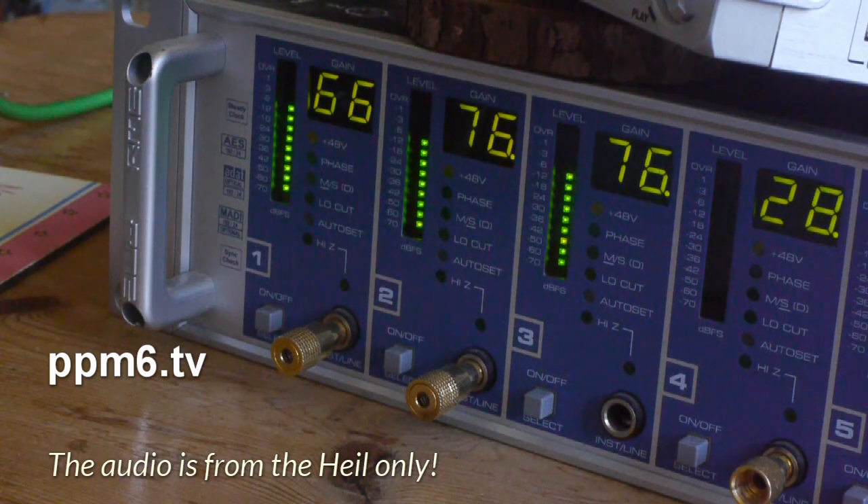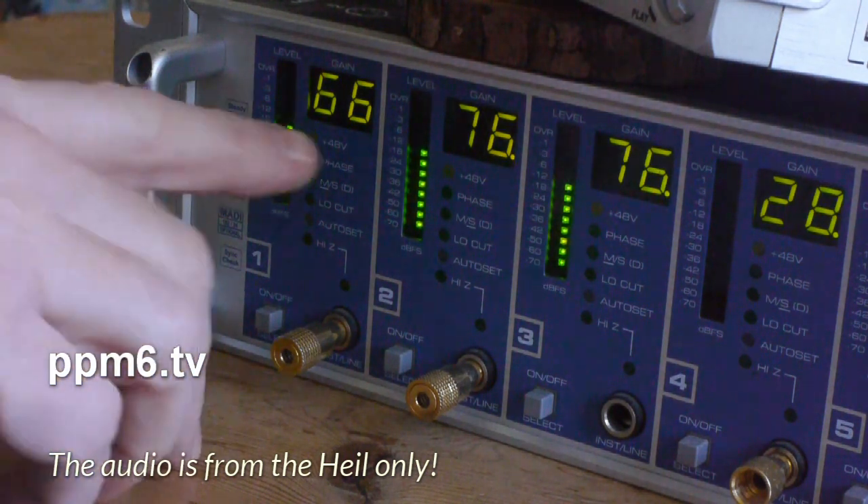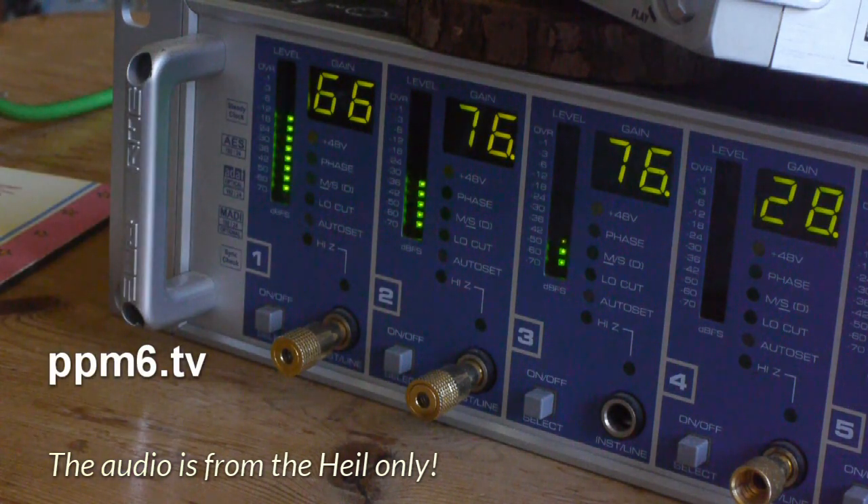Let's check out those numbers. I'll grab my noise maker and switch it on. The Heil, as you can see, has got 66dB of gain in it, just up against the windshield. Next to it, the Shure SM7B channel — you need about 10dB more gain to get into the same ballpark. Now to the Aston — same, same, really. Maybe I could knock a little bit of gain off that, but you can see they're in the same ballpark, whereas the Heil has a bit more gain and won't need quite so much amplification.